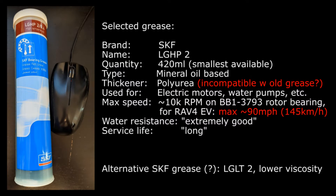You could spend an entire episode on grease selection. I highlight just a few properties of the chosen grease. I chose SKF grease because it's an SKF bearing, which felt a bit safer — see the SKF website for more guidance. Note that this is a polyurea-based grease, which may not be compatible with the old grease, meaning it can react and result in hard particles, so clean the bearing first. Also there is a speed limit with this grease; if it's not sufficient, consider the LGLT2 grease, which has a lower viscosity.